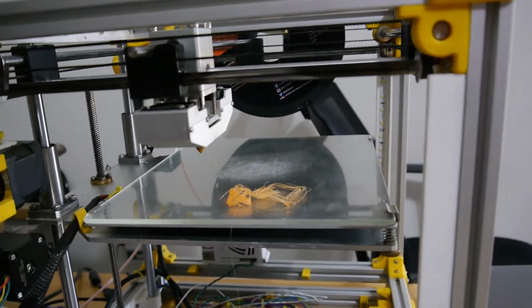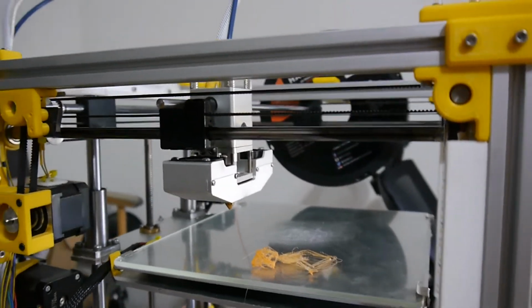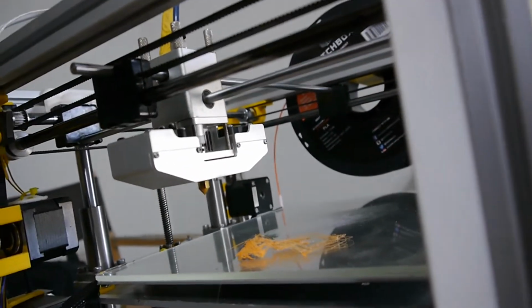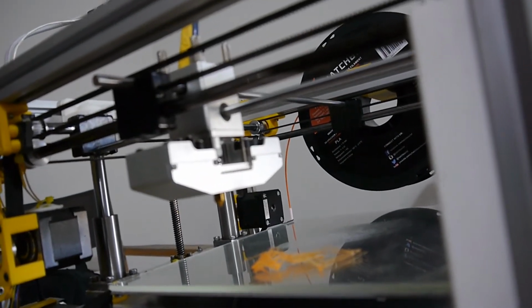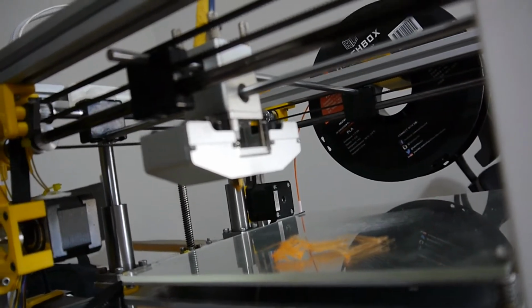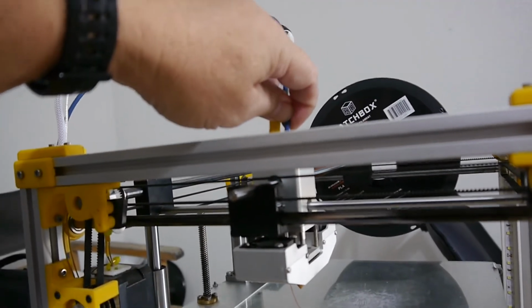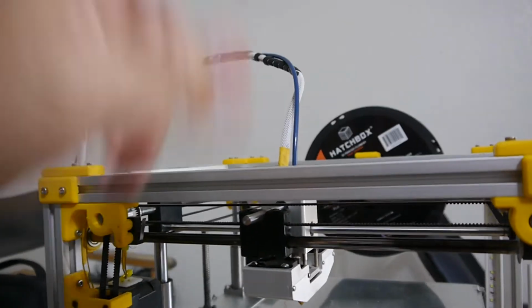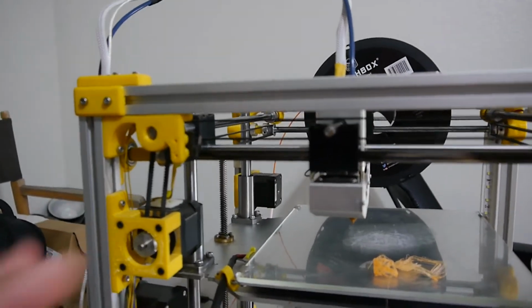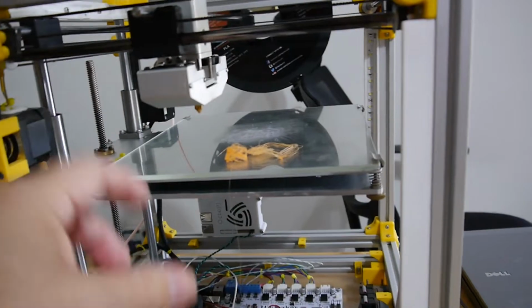And I was like, well, is the nozzle clogged, all that good stuff? Well, you can see I had replaced the nozzle with a 0.4. I think it was a 0.6 that was on there. I cleaned everything out. It was a fresh cut on the Bowden tube that went down. And when I heat it up and manually feed it through, it's flowing great.